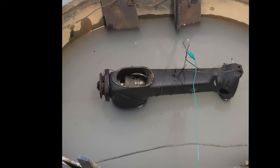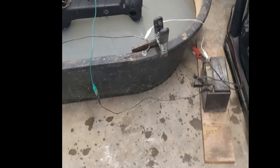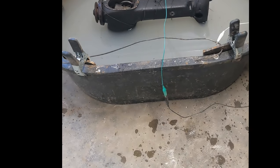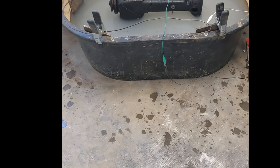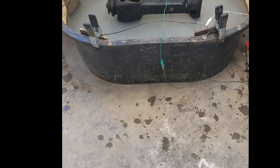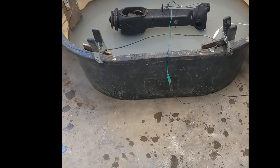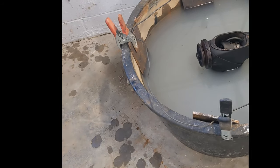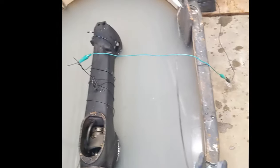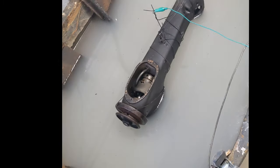My tank is filling up. If you haven't seen this before, it's my electrolysis tank. I basically have it hooked to a battery, which is then hooked to a battery charger. So as soon as the water is covering the top of the machine, I'm going to go ahead and turn on the battery charger. The water has a combination of washing soda and a little bit of TSP powder, just for extra cleaning ability. That seems to work well on really nasty machines. The things clipped to the outside are big steel diamond plate panels, and then there is a big wire connecting them all — just positive and negative, everything like that.